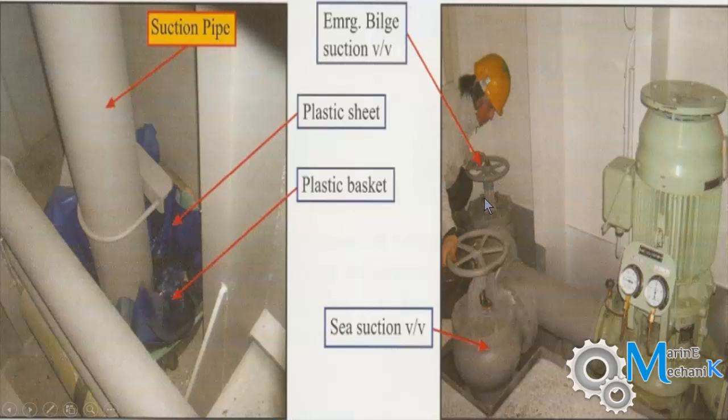Since it's a new vessel, the valve has not been painted red; however, you can see the Korean engineer trying it out. The pump will be running because the main seawater pump is used continuously to cool all the auxiliaries via the fresh water cooler. This valve is fully open and seawater is passing through it. Note that the emergency bilge suction is kept closed at all times.